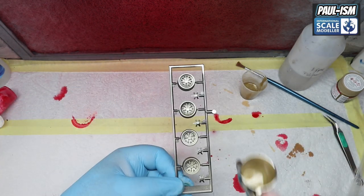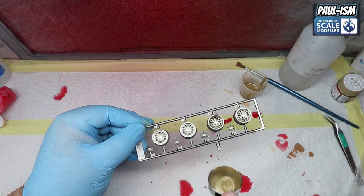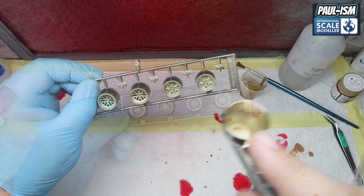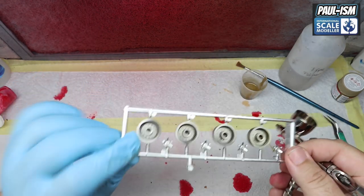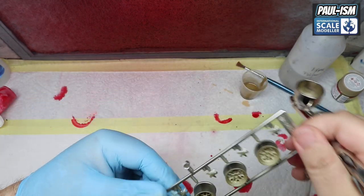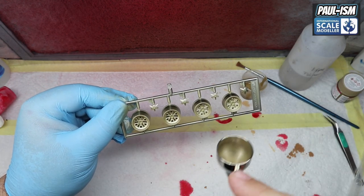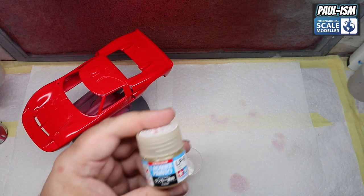The LP62 has been thinned approximately 50% with Tamiya thinner with Retarder, through the Apex with a 0.2mm needle at 18 PSI. Getting some light coats down on the wheels — probably about 3 coats in total. I spray the front of the wheels directly on, then the back, then each angle at about 45 degrees, turning as I go. This ensures full coverage in all the spokes and recesses. Second and third coats going down — the wheels are looking great, very nicely pigmented paint and a really nice colour that's going to look good against the red.